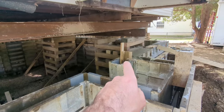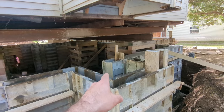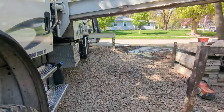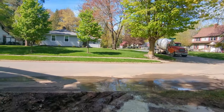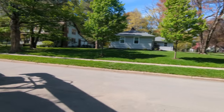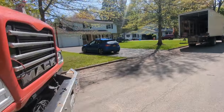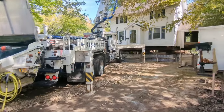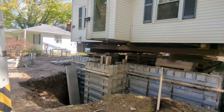We've got a real nice opening to put the new beam through, and the outside corner will be notched. The same goes for the other end — no good reason to put something on the outside since the beam won't try to slide and would just break off anyway. They know their materials and don't ask too much of them or try to create geometry that doesn't make sense. This is our second concrete truck with a third sitting over there — quite a lot more than the footer, which was around 40 yards. They planned on three trucks.